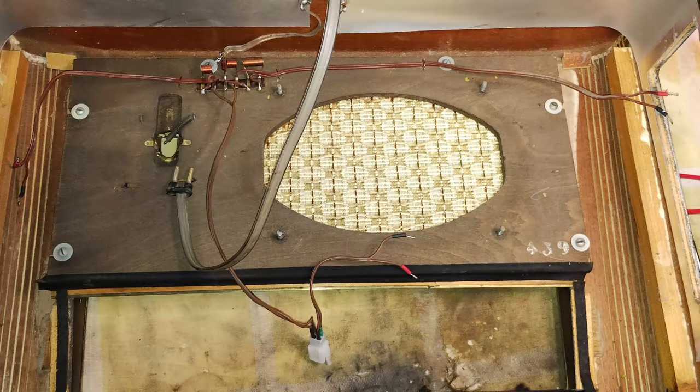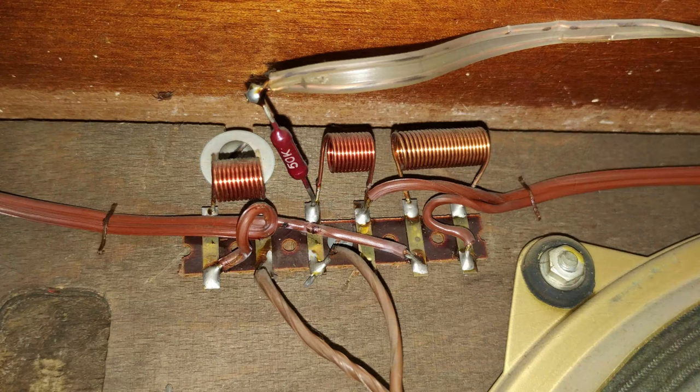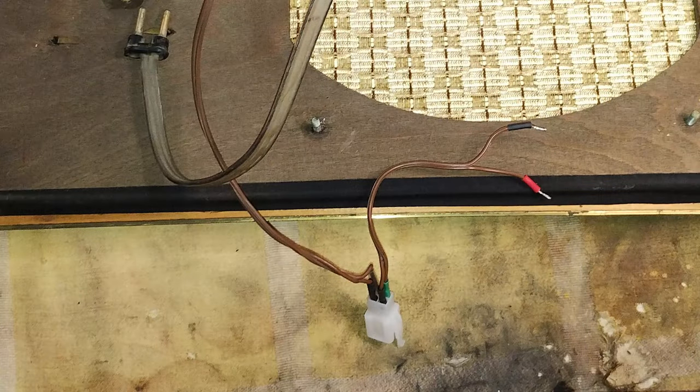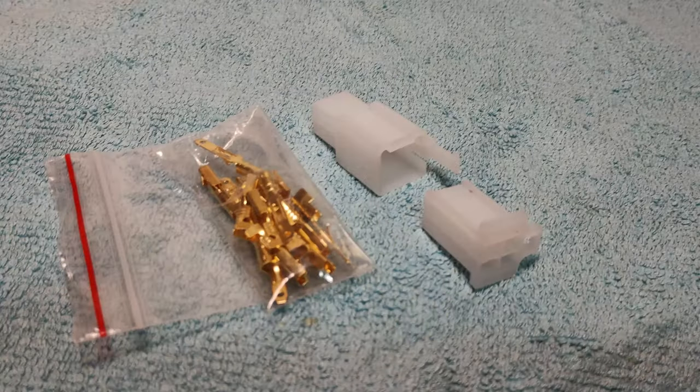The schematics do not show that the internal antenna is connected to ground using a 50 kilo-ohm resistor, taking advantage of the loudspeaker wires. Presumably for the same reasons, all the blocking impedances that are visible in the real implementation are not reported on the schematics. Please notice that, to simplify the connection to the output transformer, a 4-pin automotive spade connector was used.